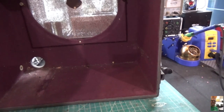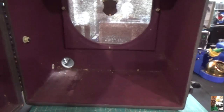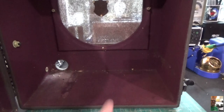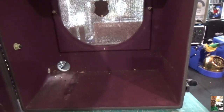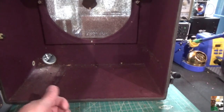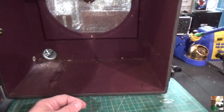And treble, I'm sorry, not tone, treble and bass, and my input jack right there. On the back of the amp, we're going to put another potentiometer for vibrato. Actually, we'll probably throw that up in the front. Vibrato, and then we're going to have a pot in the back for adjusting the feedback. And that's how you modify the tone of the amp.